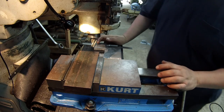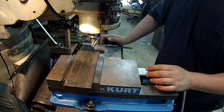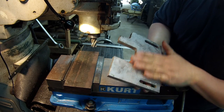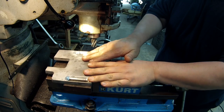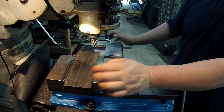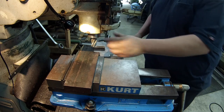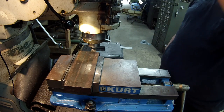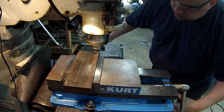It's down hard on the parallels. I thought I was going to have to mill the sides just to square it up, because it's hot rolled — but it's nice and flat. Here's the top plate, and you can see how rough it is on the bottom. I set it on there and it sits nice and flat with no rocking, so I'll probably just leave that alone. What I'm going to do is square up the sides, because I cut it just a little bit longer than 8 inches and I want to true the ends up so I've got a nice end to work off of over my center distances. I'm just going to use a little hog mill — 3/4 hog mill.